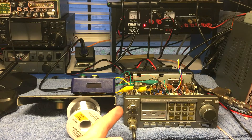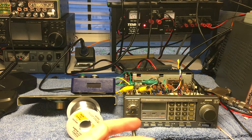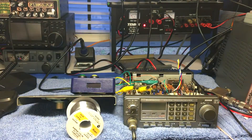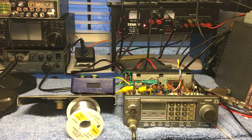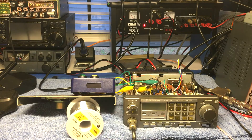This is the 45-watt model; they also made the TR-7930, which was the 30-watt model. This one here is great except for the missing tone board. You can use it on simplex, use it for data, do whatever you want — minus using it on repeaters, since it doesn't have that option. The TU-79 tone board was an optional add-on. Back in the 80s up until probably the 2000s, the majority of radios and repeaters were wide open, so you could just put in the offset and be good to go. As things progressed, everything got PL tones, leaving radios without that option kind of on the shelf.